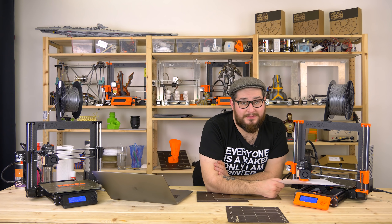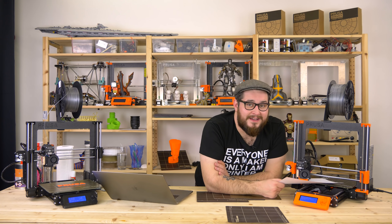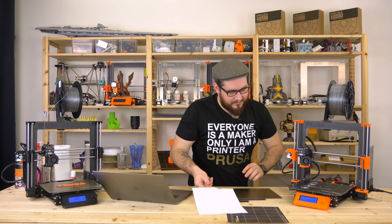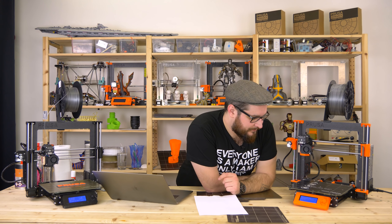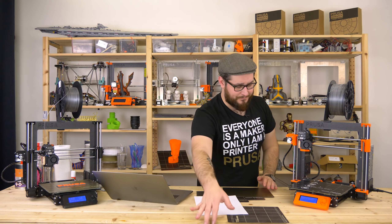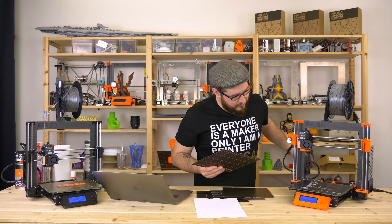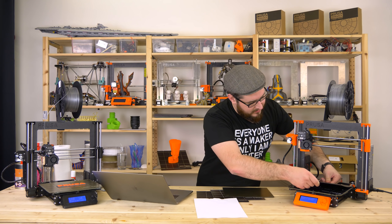It's still important to hold the piece of paper between the nozzle and the bed — if you remove it and walk away, that's exactly the time when the nozzle will dig into the bed. The second round of the skew calibration is done. The printer then asks you to place the steel sheet back. The sheet has two notches on the back and there are two pins on the back of the bed, so you can use these to align the sheet exactly on the bed.